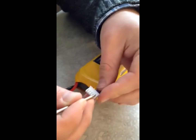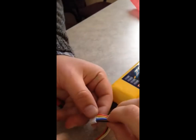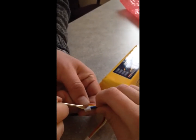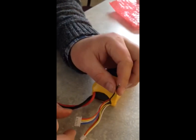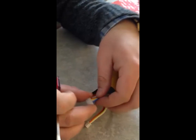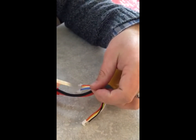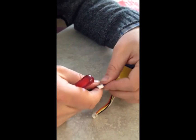With some help pulling, there we go. This one here we don't need, so we'll just tape it off in a second. Now we're going to shift the blue one over, the white one over — just shift them all over one — so that when we line them up on our balance port they're all in the right spot.